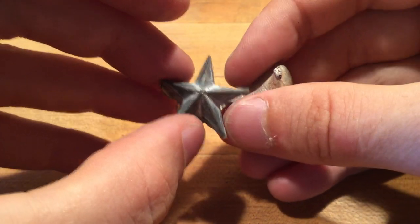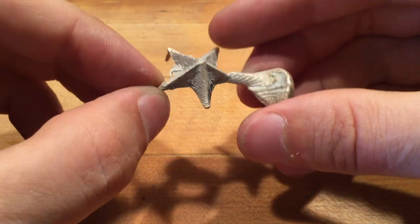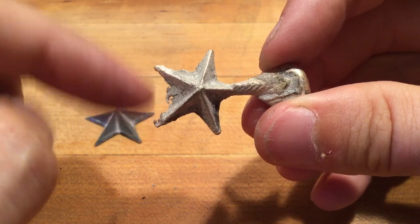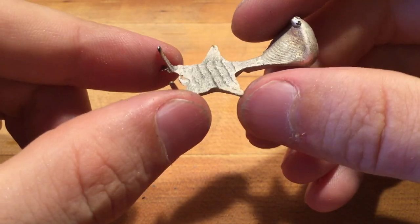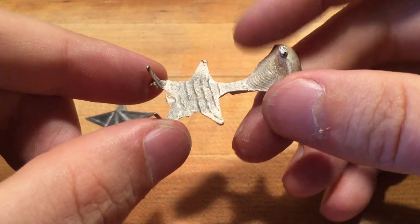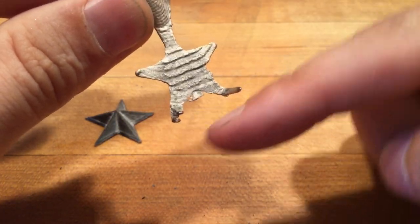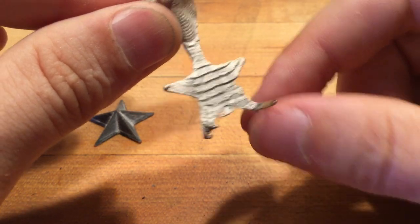the casting part wasn't pressed in as deeply into the mold, or there were some blind venting issues that we were having at the points, because it looks like this point on either end cast well, and these ones cast a little short. You can see an indication of a vent here, but not an indication of a vent there, which implies I could put more vents in, I could have been a little hotter in the cast, or simply that when gravity is working with you, it's very easy to fill these bottom two footies. But once you get up to these top points, a little extra venting would be helpful.